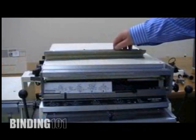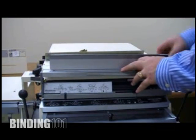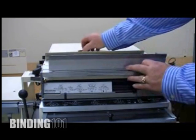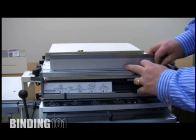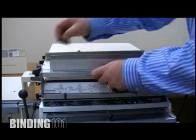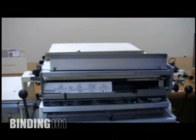Back on the stacker, we can now add on our guides that will adjust to guide the paper into the ejector. You'll just take your little brass screws, tie those into these holes that are on top of the machine, and put your guides in place. You have a front guide that's a little bit taller and a back guide that's a little bit shorter.